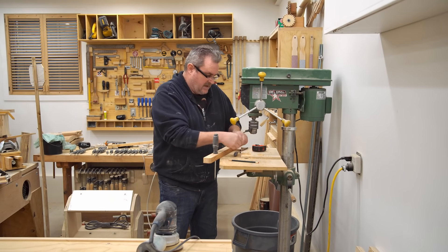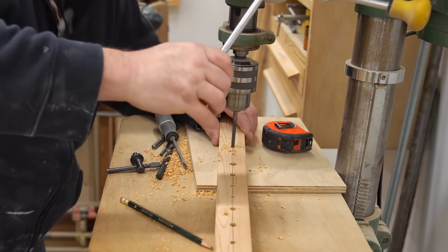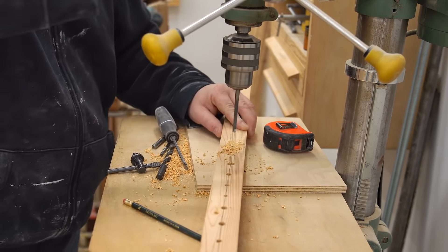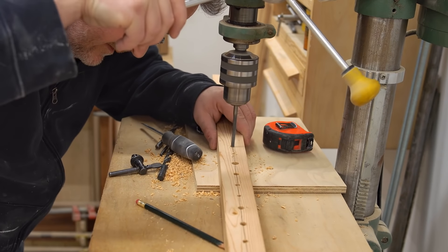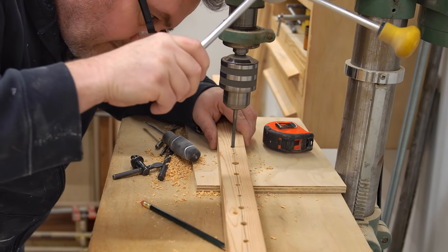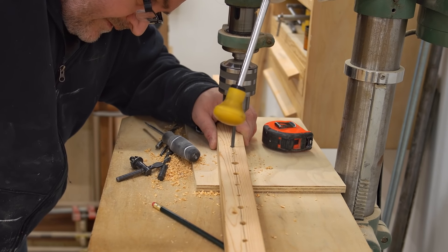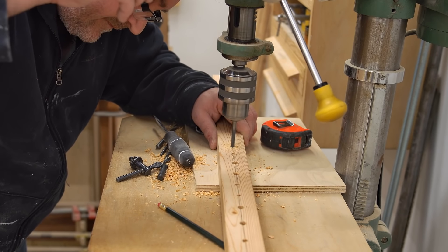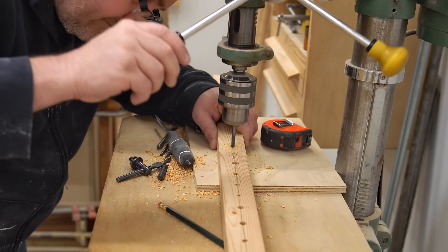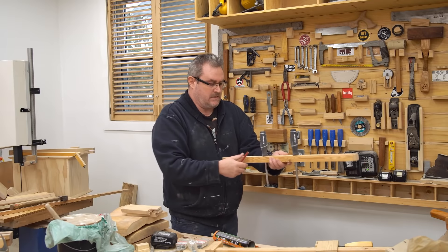It's just the same amount of time — the only thing that really takes any time is changing the bits, and that's not a big deal. Now I can make this hole bigger overall, but then the screwdriver will hang down lower than the other ones and it'll look kind of crappy. So instead I'm going to make it into a slot just by drilling right beside the hole that I already drilled. If you take your time and do that slowly with a sharp bit, it'll work every time.